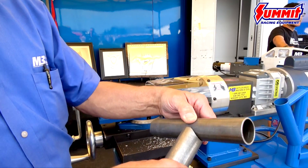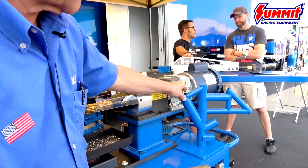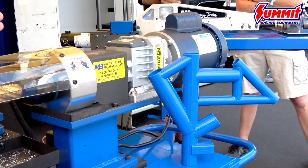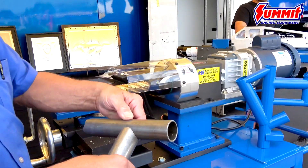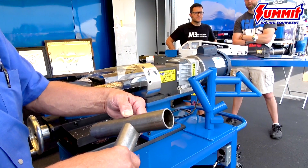Of course, this is a simple 90-degree notch — the most basic. But as you can see in some of our examples, the extreme angles we can achieve with our notching machine — just by adjusting the vise and presenting the tube at a different angle — we can feed that tube in and produce an angled cut with the same quality as this very basic 90-degree notch.